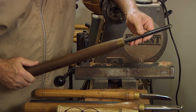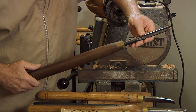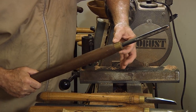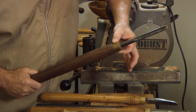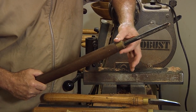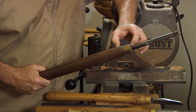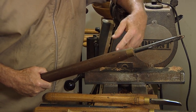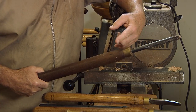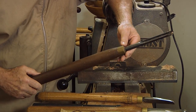I have actually thought of sometime going down and getting a sledgehammer handle and cutting it into lengths, but then the problem you have is getting a ferrule of some sort on the end. You do need this — it's a stress point. The fibers can split, especially if you have a catch, and this basically reinforces it. Dave Ellsworth does a handle which he turns kind of eccentric like a sledgehammer handle, then takes some colored nylon or Dacron twine, wraps it around really tight and chases that with super glue, which works for a good ferrule.